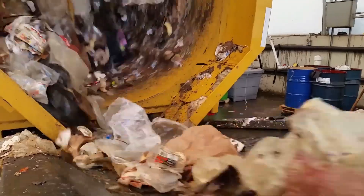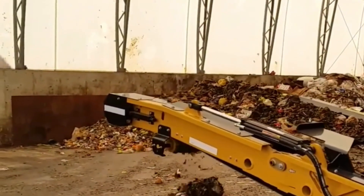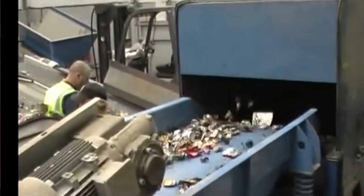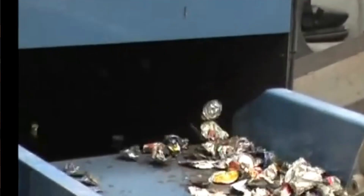Let's go back to trommel fines cleaning, because this is the big problem with single stream recycling. Anything that comes out of a trommel — a rotating drum — is a nightmare to separate. Everything gets all mixed together: sawdust, nails, everything. It's a real pain to sort out. The bigger holes in the trommel, that material is also quite labour-intensive to sort. You will do it over some sort of blower, which will take out all the light material and you'll be left with some kind of stone or usable aggregate. If you don't use a trommel and you pick everything off the floor, you don't make trommel fines. So if you have a tin of paint, you put the paint in with your waste storage for your paint tins and it'll never come in contact with all the soil that goes through the trommel — eliminating the trommel fines.